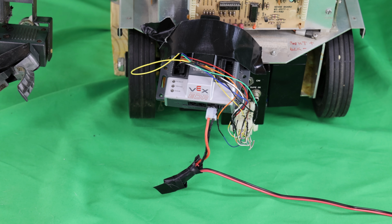I'm working on another upgrade for robots that don't have any, the electronics aren't working at all, or the robot just doesn't work for bad power supply or bad motherboard, and you know, these boards are very rare. They're very hard to find and expensive. They can be found on eBay, but the components are just getting older and older. They use basically a lot of TTL, and some of those go bad just from static or background radiation even. Alpha particles can do damage to them, and of course they're very static sensitive.